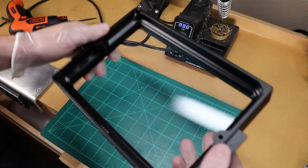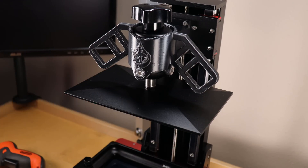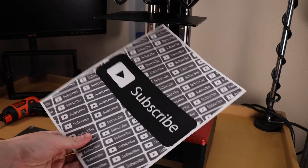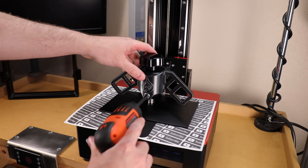It's just a lot of little bolts and a little time consuming. With the screen replaced, I need to re-level the build plate, so I'm just going to loosen its bolts so it's free moving, and I need to remove the vat as well. For leveling, all you need is a piece of printer paper — you want to place it on top of the screen, home your build plate on top of it, and tighten your bolts.